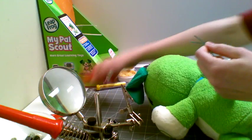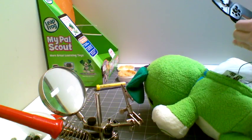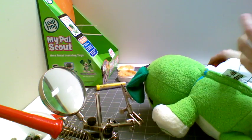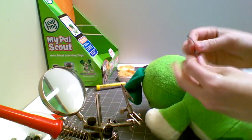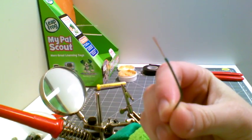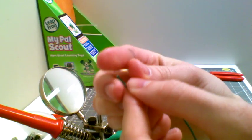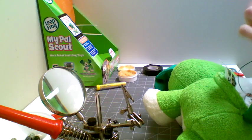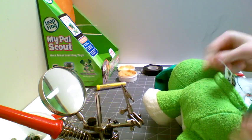Now I'd like to strip these wires, which just means to take the plastic off. You can see I have the two switch wires, and you can see the gold copper of the wire and then the wire casing for both. The first thing we're going to do is twist those wires together so they form a nice single wire on both ends.